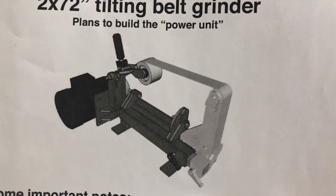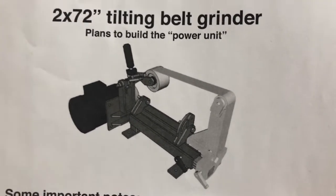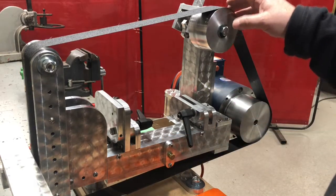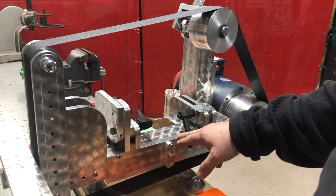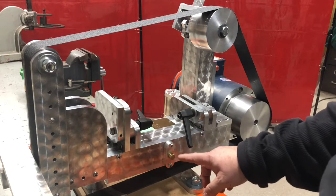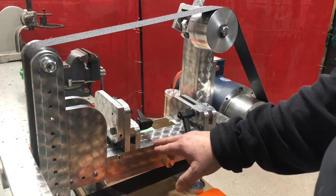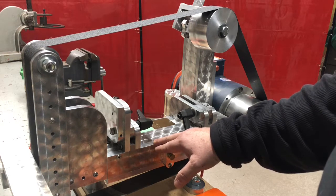This is a picture of Jeremy's belt grinder — it's the weldment, welded out of half-inch steel bar. I'm a much better machinist and fabricator, so I machined mine out of half-inch aluminum. Most of the parts here, besides the wheel and the handle, are half-inch 6061 T6 aluminum. I chose stainless steel quarter-inch fasteners for most areas because stainless steel won't rust and it really makes it look nice. I engine-turned most of the surfaces so it looks like the dashboard off of a 60s British sports car.